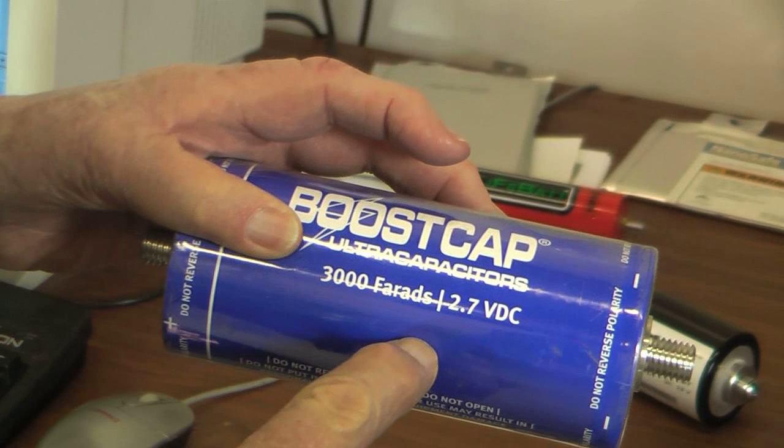The electrolyte in the capacitor is much less sensitive to temperature than the electrolyte in batteries. It works out that the capacitance changes almost none — essentially zero — between minus 30 and plus 30 degrees C. And the resistance might only change by 10 or 15 percent when you go from room temperature to minus 30. So that's why it's a good match.